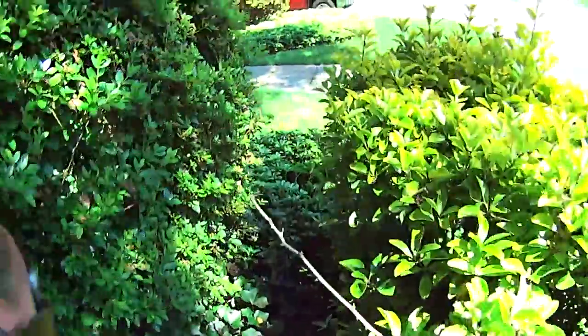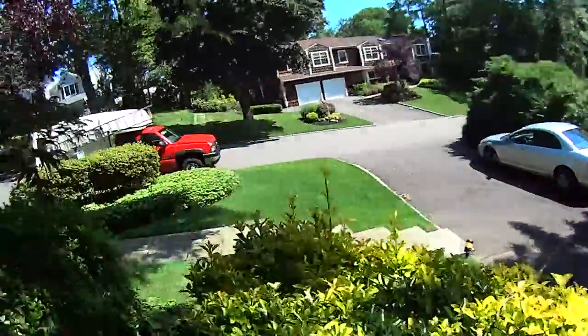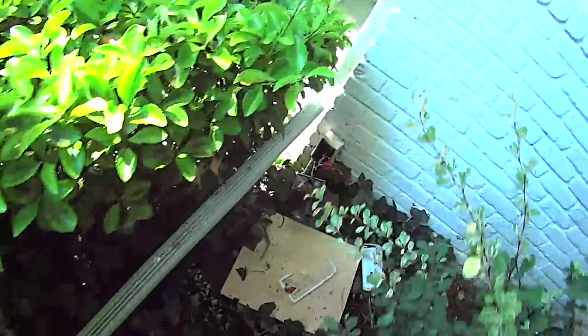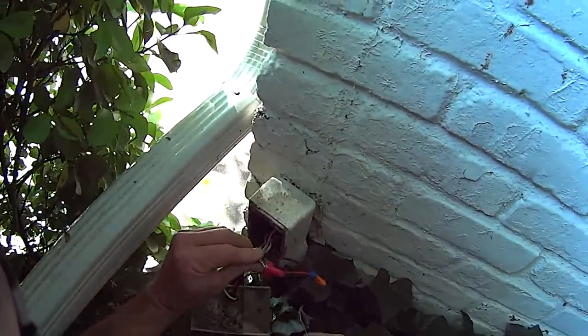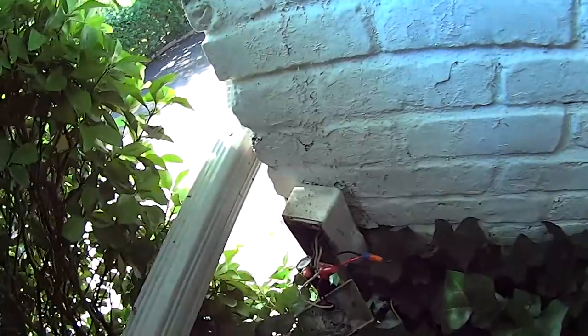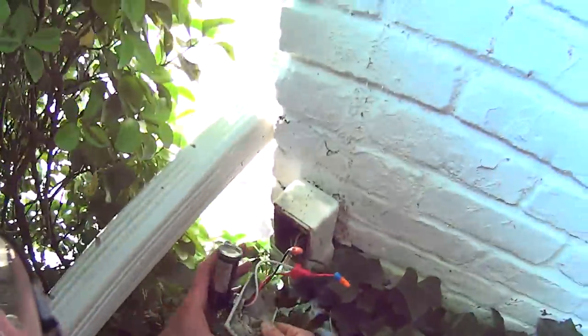We could take a look over here. We're going to give it a minute because it has to get used to the light — these photoelectric sensors don't work instantly. Those lights should be going off in a minute. Just to double check that's actually the circuit, I'll pull this one and we'll take a look. Okay, they are off — the photoelectric is just warming up; sometimes they take a couple of minutes. A good way to test these things if you want to test in the middle of the day: take a piece of heavy-duty tape that light can't get through, cover the front of the sensor, and make it think it's nighttime.